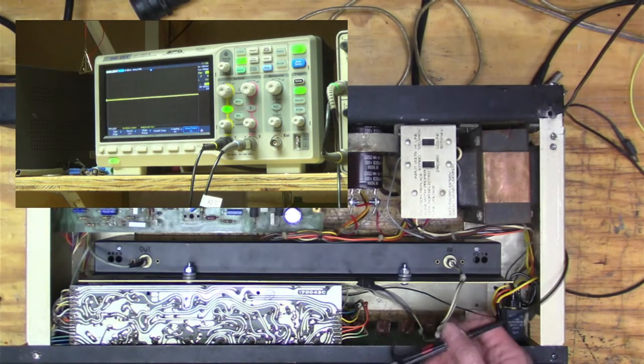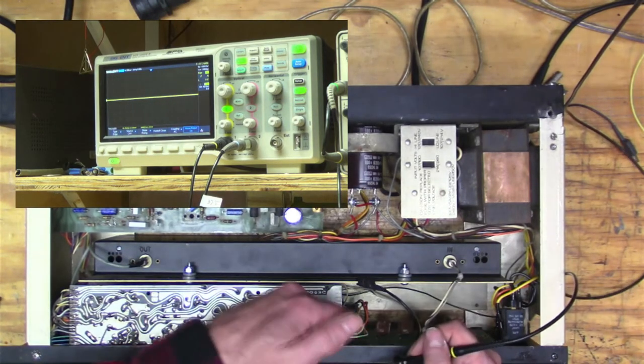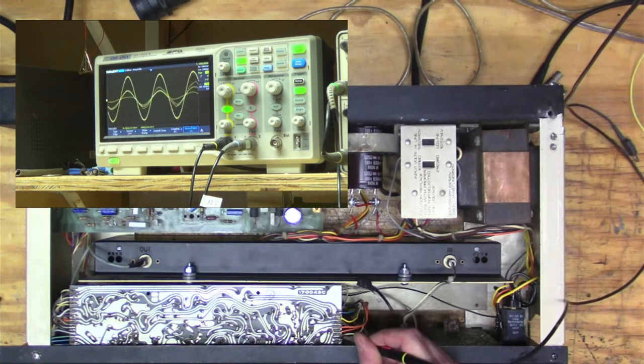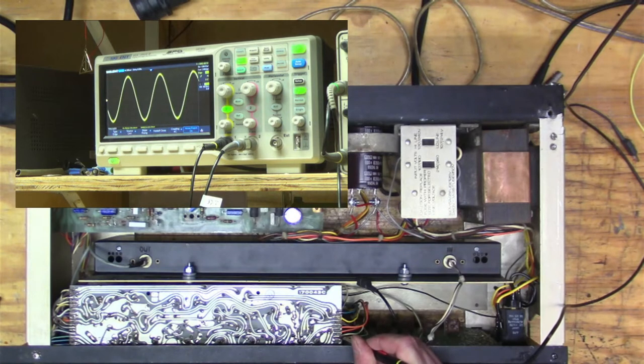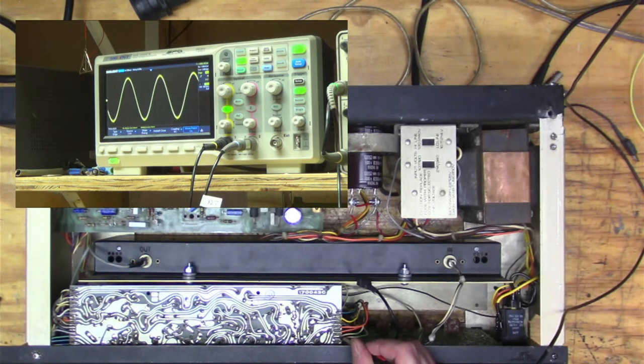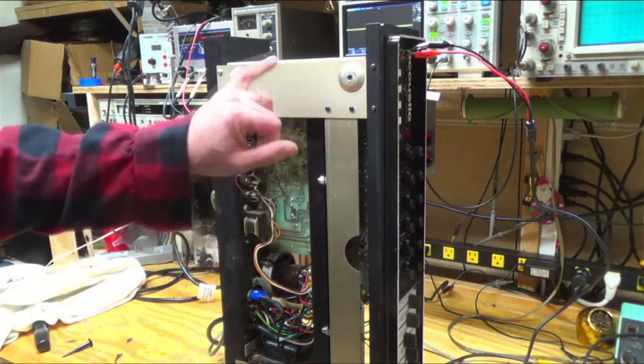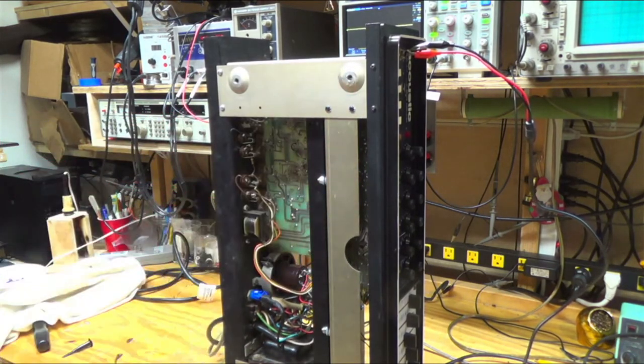So here's our green and white wire right here, and the reverb's actually on the other side. But if we look here, we've got about 300 millivolts, and that seems like a reasonable signal to be coming in to that section. So now we've got to find that section and start looking at it. Unfortunately, to get to this board, we have to take this out and this out. So